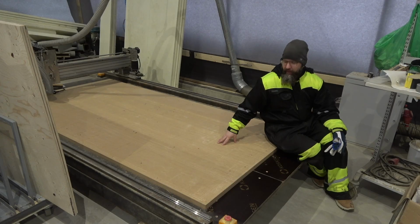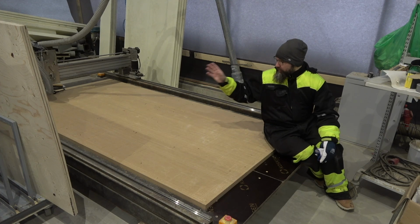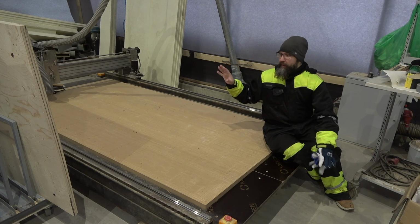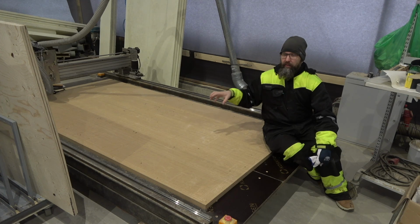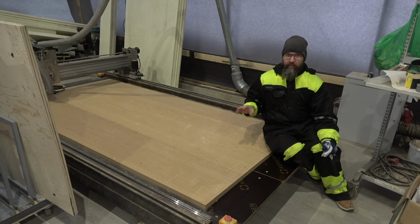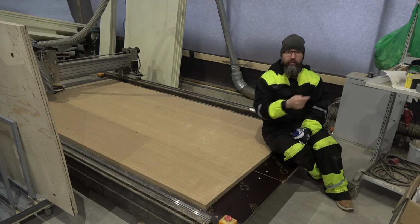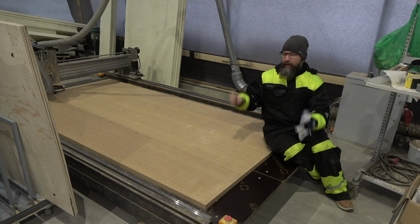One little detail I want to mention of using this machine, it's now powered off, so now those motors are unpowered and you can pretty easily push them and move them when there's no power. So I really need to be careful when this is turned off, not to move those, because then the calibration goes out of place. So before I put anything here, before I do anything on this, I turn it on so that the motors are energized and they stay where they want to stay.